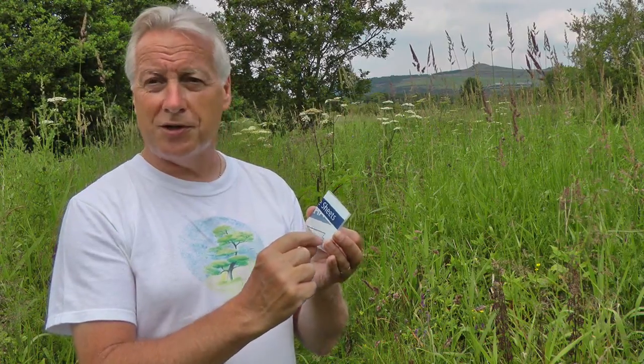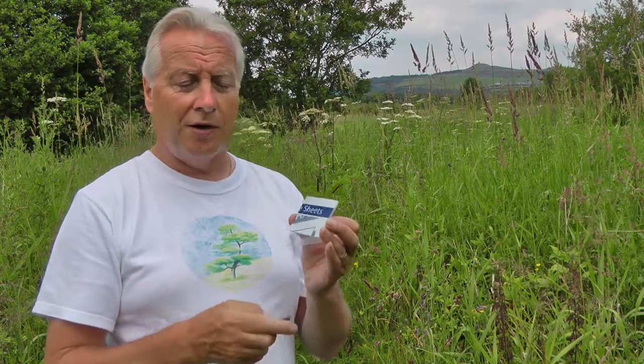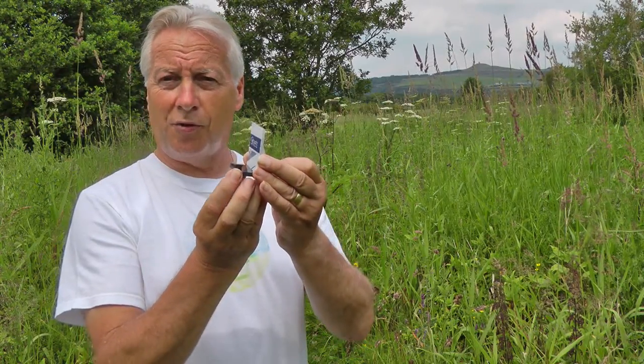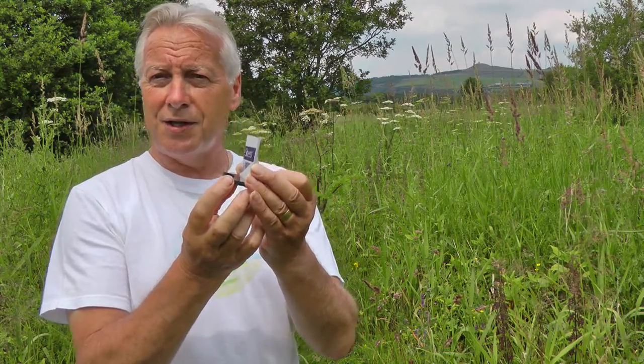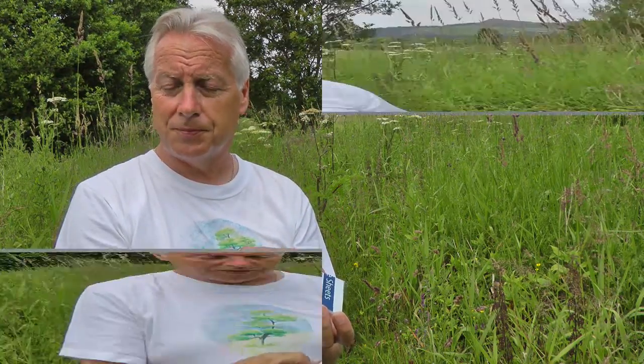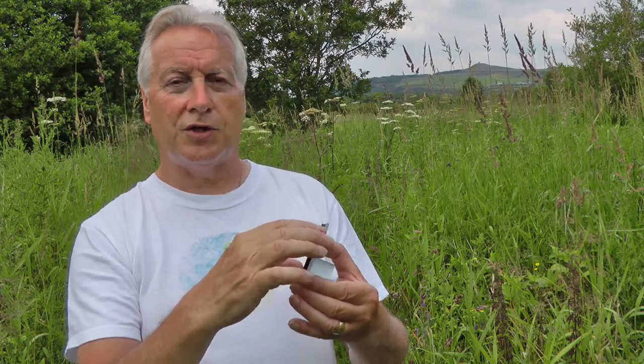I cut the Perspex to the required size, and then on one surface I took off 5mm of the protective film to expose the surface of the plastic. I then used some super glue and bonded on a 20mm wide piece of plastic to the base of it, therefore forming a right angle shelf. After that dried, I could then drill the base to fit exactly where it needed to be on the camera sole plate. Once we've removed the protective material, we can fit the mounting plate for the adapter. After removing the protective film from the front surface of the display, we can bond the adapter plate for the Perfect Viewfinder onto that screen, situated at the top, in perfect position for the viewfinder.